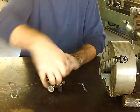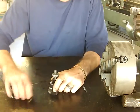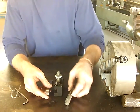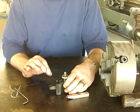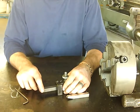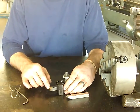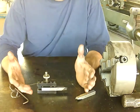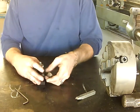It's a little easier when it's on the lathe. I can slide my tool out and put another tool in. The distance that this sticks out of the tool holder — you want that to be the minimum distance possible. The further it sticks out, the more this is going to wobble on you and you're less rigid. The further it's in, you're obviously much stronger. You have to figure out what works for you, but keep tool stickout as minimum as possible.